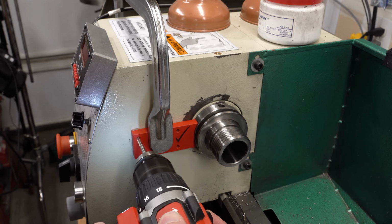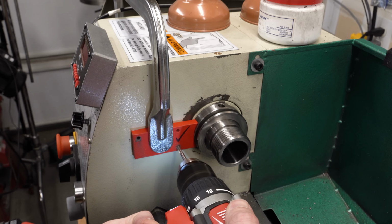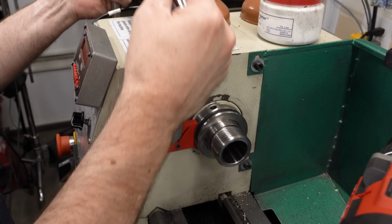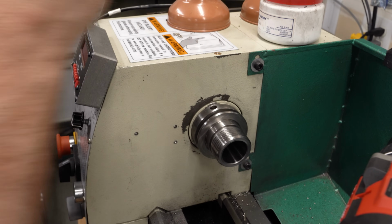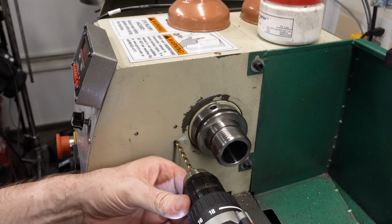Now I'm going to start drilling this with a standard high-speed steel drill. This is 118 degree standard point. And while it is raising some chips, it's not cutting very fast. I'm putting quite a bit of pressure on it. It's kind of an awkward position, but it is working. But I'm going to stop and I'm going to switch to something else, get the template out of the way. I've got these in past the point, so any other drill we bring in should stay nice and centered.